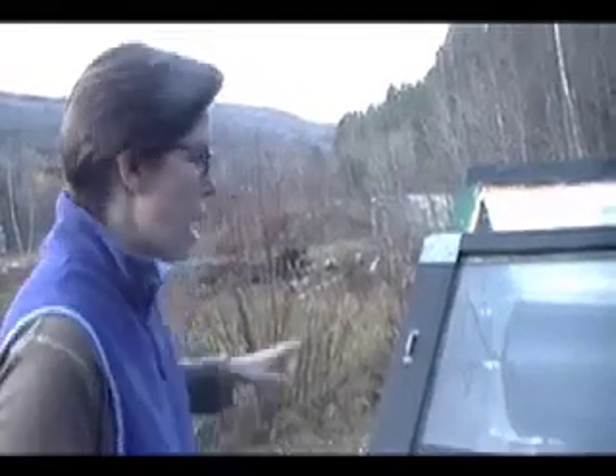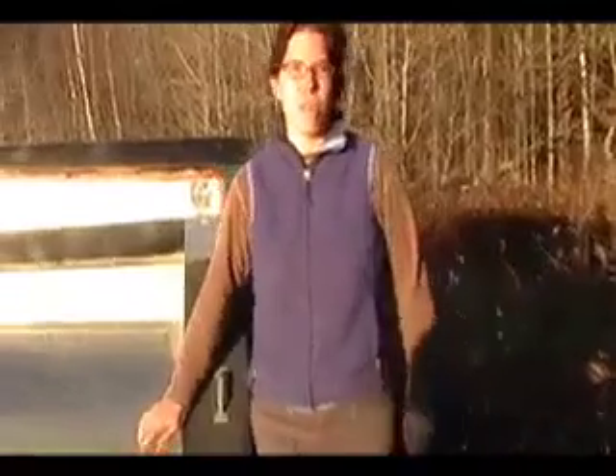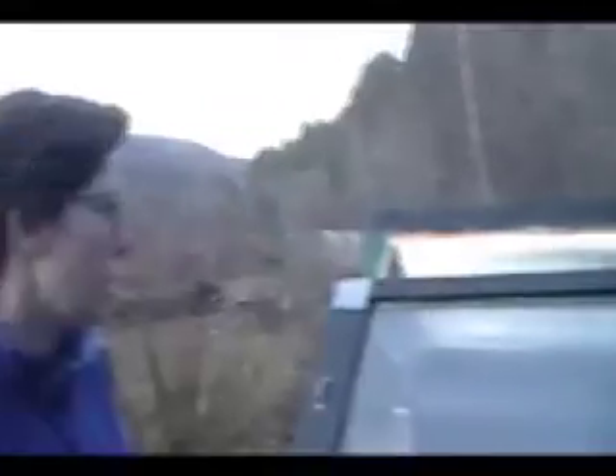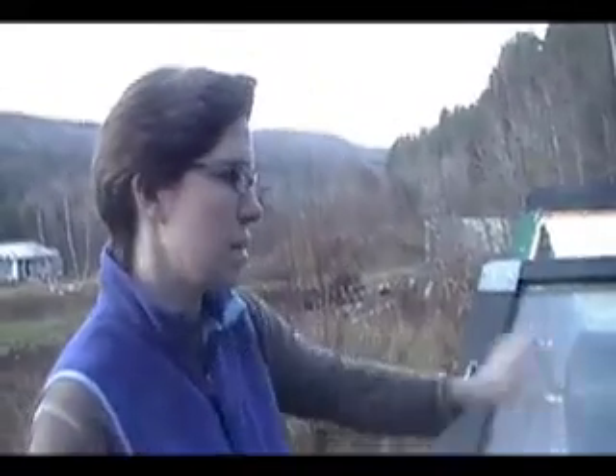For an average homeowner, you could obviously have an outdoor solar shower if you wanted to, but you could also have this right next to your house and have it preheating water coming out of your well before it goes into your regular hot water heater. The water coming in is probably 50 degrees; by mid-afternoon it comes out at about 120 on a hot day. This is a do-it-yourself kind of project that any fairly handy person could do on their own in a weekend. The materials cost for a setup like this is less than $200.